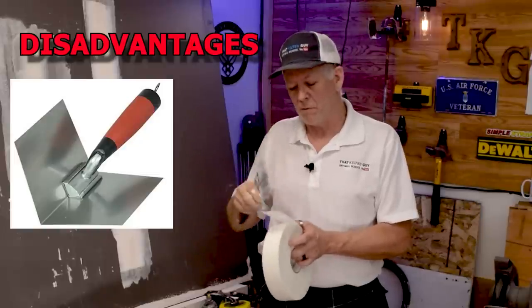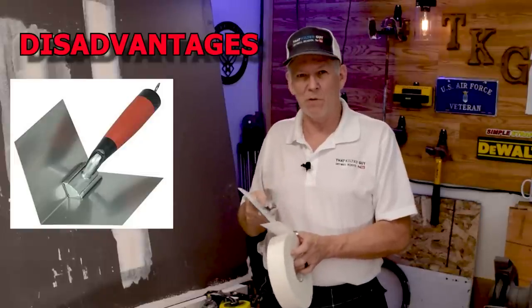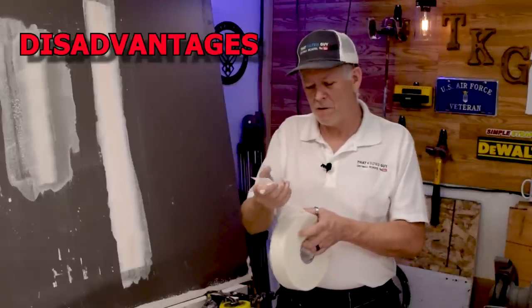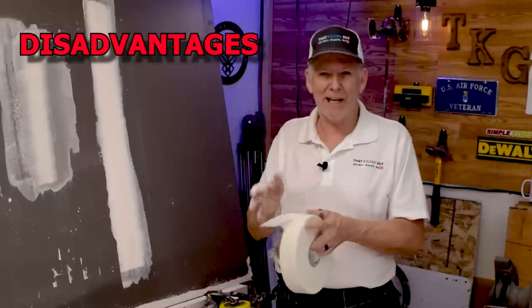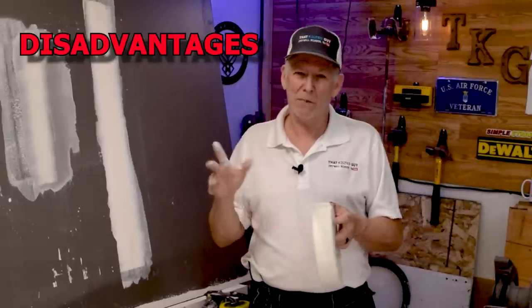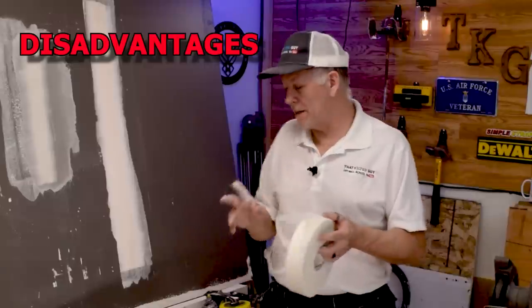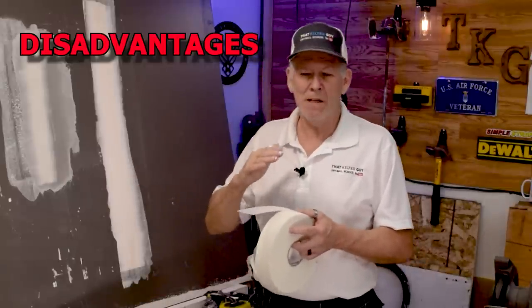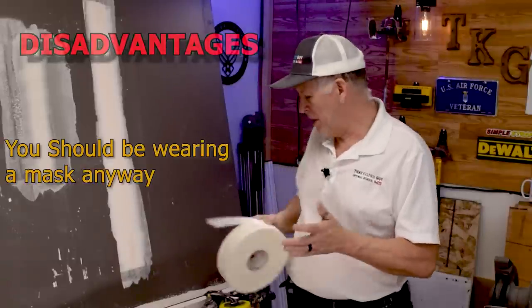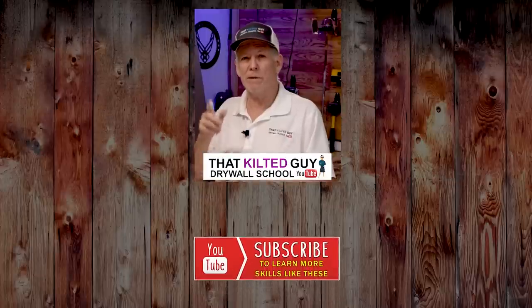Using the two-sided corner tool for novices will eliminate tearing at the inside corner. Also, because this is fiberglass, sometimes you'll get fibers in your skin and it can itch or irritate, so if you're sensitive that could be a disadvantage. Finally, if you're sanding and you sand into the tape you'll raise some fiberglass fibers — but you shouldn't be sanding that far down anyway.